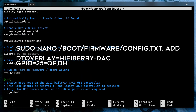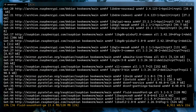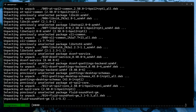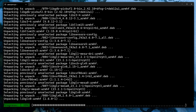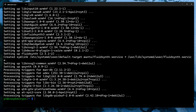The software that plays back the general MIDI files is FluidSynth, so install that by typing 'sudo apt install fluidsynth'. FluidSynth is a sampler synthesizer that uses soundfonts — sample libraries that provide multi-layered samples with envelopes, LFOs, filters, chorus, and reverb effects, everything you'd expect from a sampler PCM synthesizer. FluidSynth comes with a 6 MB and a 128 MB general MIDI soundfont, but we'll download some alternatives later.